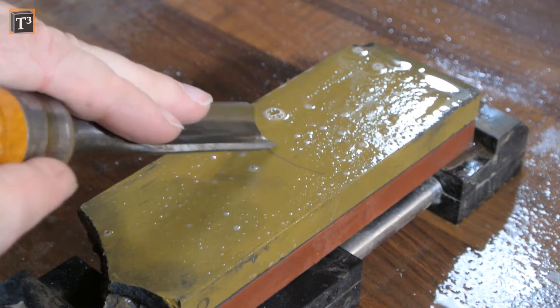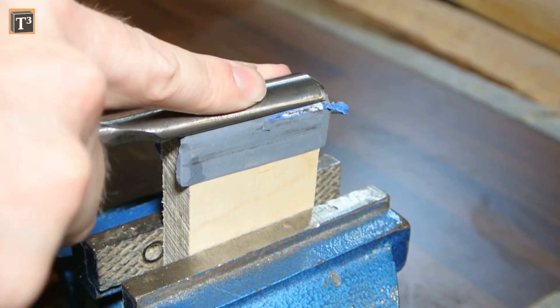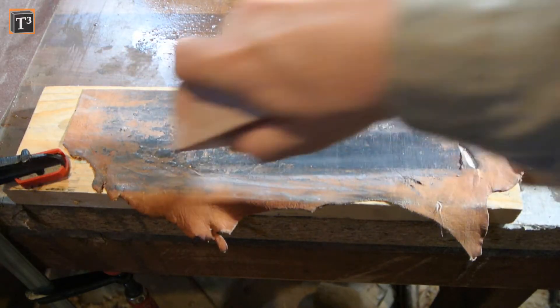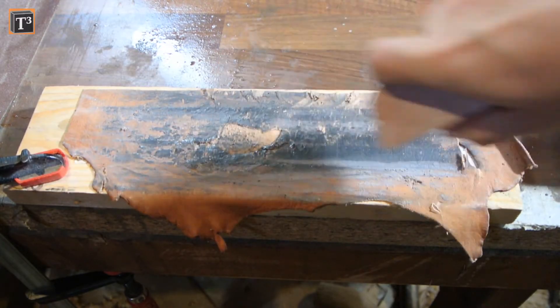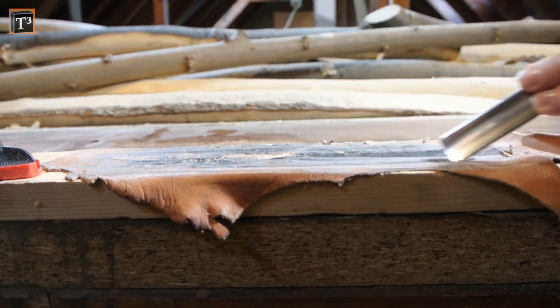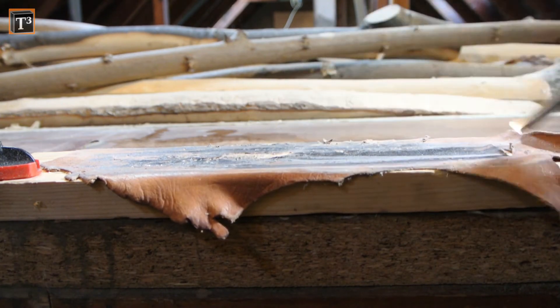Follow the same procedure again. Although this is not necessary, I like to polish my blade. For that reason I rubbed some abrasive material on a strop, which is just a piece of leather glued to a board. I then pulled the gouge firmly back on it, twisting it a bit more after each stroke to treat the whole blade.